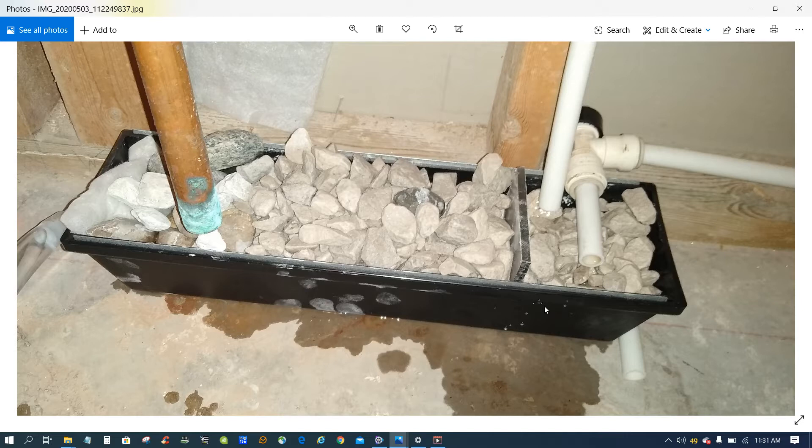Local stores don't even carry it — they have no idea what it is. But reading the manual, it says the drain condensation that comes out from the drain line on the bottom of the tankless water heater is pretty acidic and can damage cast iron and even concrete. This cost me probably around ten dollars or less.